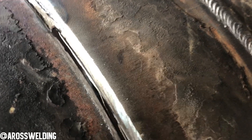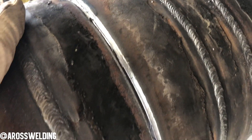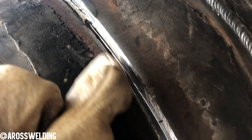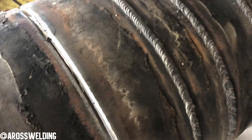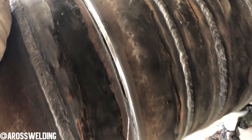After you cut it, you'll notice that landing is going to be pretty thick, so you'll actually want to go in with the grinder and soften that landing a little bit. Another thing you've got to be careful about is cutting too fast — those burrs. If you've used a cutting disc to cut anything structural, or like a chop saw, that leaves a burr. It does the same thing here and that burr is on the inside — and that's not good. You want to get all of them out. Cutting it slow is gonna help with that, and then running the zip disc back in at a little angle to get them burrs back off, because if you were on a hard tie-in you wouldn't be able to get these out from the inside. That just gives you guys a general idea.